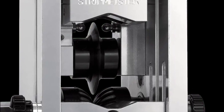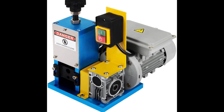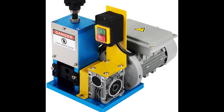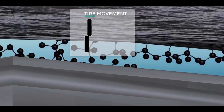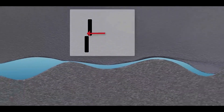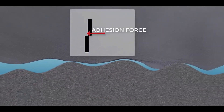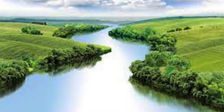Usually a roller gets cranked via worm reducer powered by a single-phase AC motor. This widely spread design has a few disadvantages: excessive weight, size, and noise of the gear motor assembly; starting motion without acceleration, meaning jerking; the inability to reverse or smoothly vary speed in a wide range; unstable wire separation process due to unavoidable transmission backlash, causing wobbling; and the inability to operate remotely where a power outlet is not available.